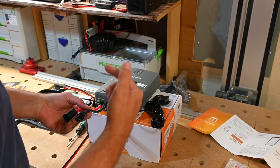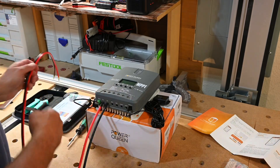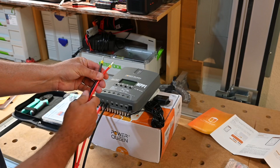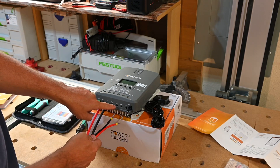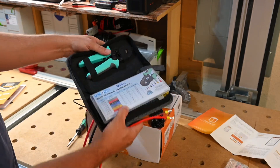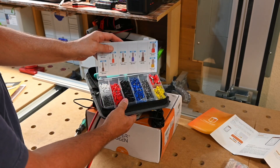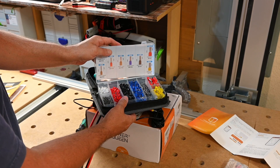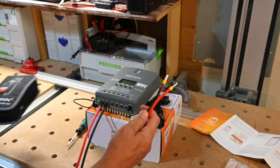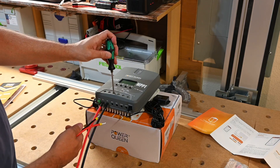I've got my PV cables inserted into the MPPT. I did go ahead and create some battery cables using ferrules — these are the ferrules I'm talking about that I like to use. I bought a simple ferrule kit that comes with a crimper and quite a few ferrules for different size wires. These kits are around 20 bucks and you get a ton of ferrules. I truly think this is the best type of connection, so I'm going to go ahead and put these into the battery slots.